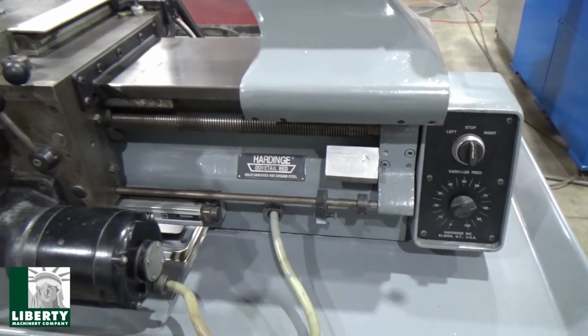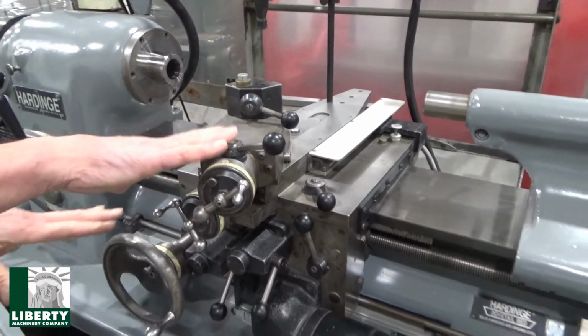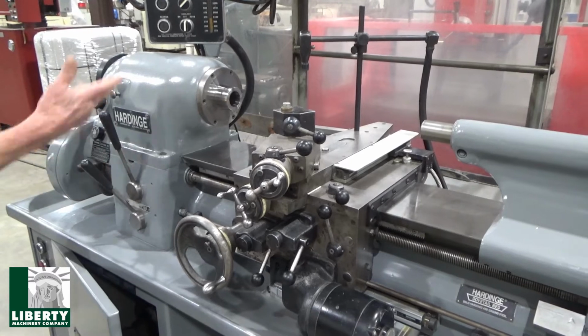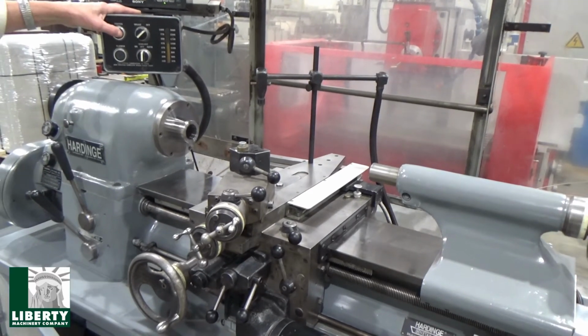That said, let's go through the spindle one time. We already kind of covered this. And then when the spindle's on, I'll come back and we'll do the DC motor, the feed drive for the cross slide. So I'm going to take this and just turn off threading and go into feed only, and you'll see the spindle sounds nice just by itself. I'm going to go high and low now in low range. We'll go full up.